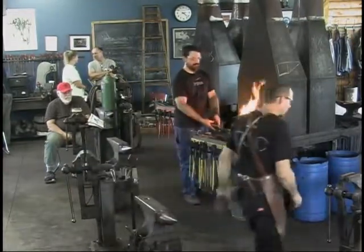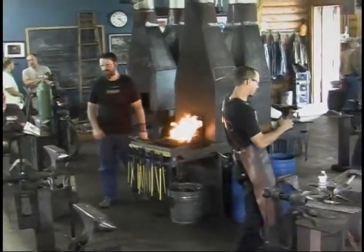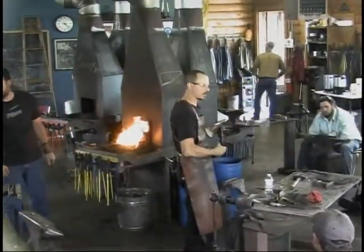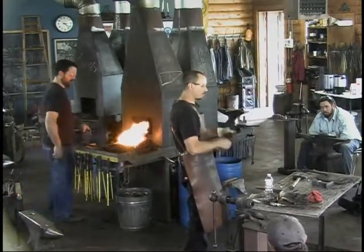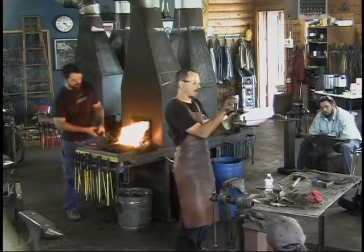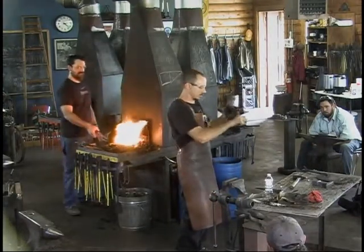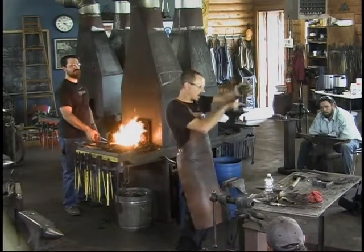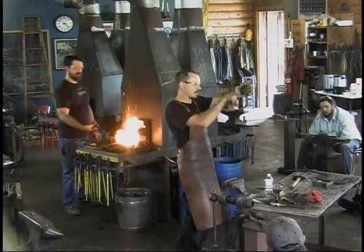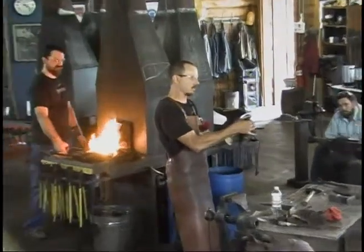Yeah, the other one, the one I'm talking about that I made for this lady interested in silversmithing, I didn't start with a chunk of railroad rail. I just started with a rectangular bar of 4140. So it's a little wider in here, and the bar comes down. I took the rectangular bar, imagine I'm running this way, isolated down out here, isolated down, forged the horns. So it kind of has a real chunky base.